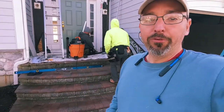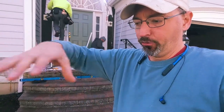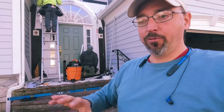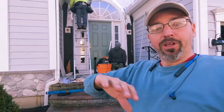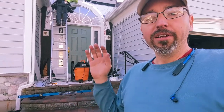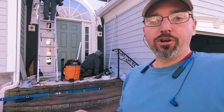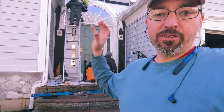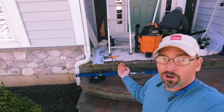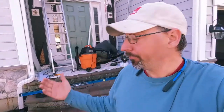If you don't do that, you're asking for problems. We already had a customer this year who had to have their landscaper come back and tear apart giant granite steps they'd put in. The landscaper pulled it all apart, we had to rip out stucco, get the moisture barriers in, and get everything layered correctly. Once our work was finished, the hardscaper came back, put those big stone steps back in place, and we brought siding, J-channel, and flashing around it to make it pretty. Too many times we're seeing homeowners let their hardscape guys throw up a set of stairs without accounting for the rain management system on the exterior, trapping water inside — in this case, two inches below grade with nowhere to go but into the wood and across the subfloor.